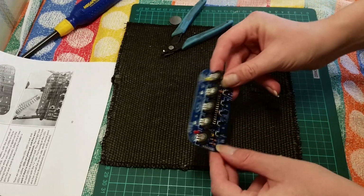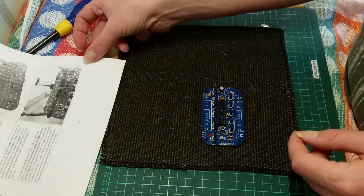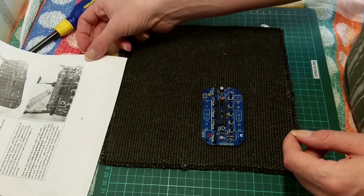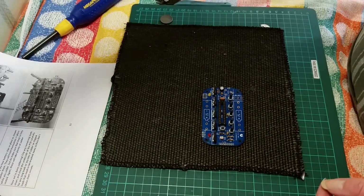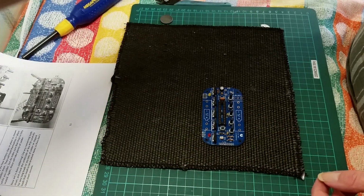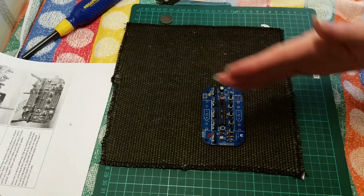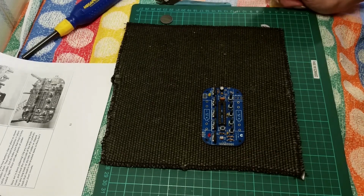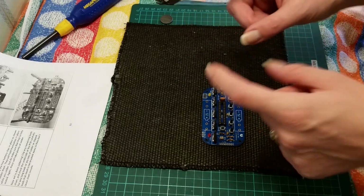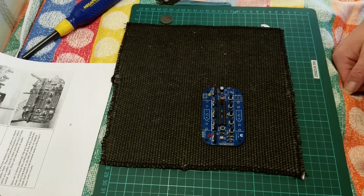So that's good. Now we can move on to sheet 11. Also worth noting, LEDs have a flat side, which is the negative. So if you imagine the flat is like the minus sign on the circuit. And you can also look inside, not always, but it's like a sort of hammer on an anvil.